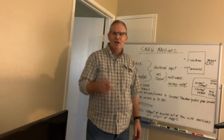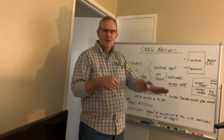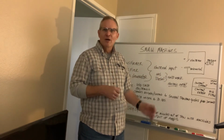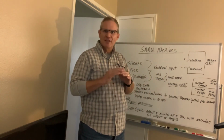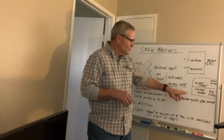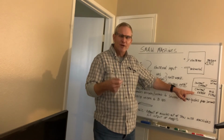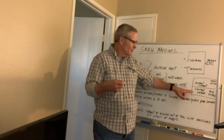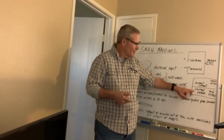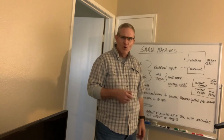I mean, you can imagine if you were welding with an electrode and the amperage just fluctuated the whole time where you were welding. You'd be all over the place. So these are constant current machines, and the amperage stays consistent. It's where you go to these semi-automatic wires, where you're activating the wire with a trigger on the nozzle, and so the wire gets fed. Those semi-automatic wires require constant voltage.